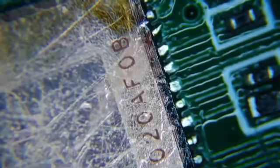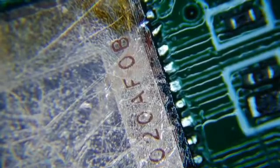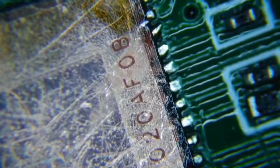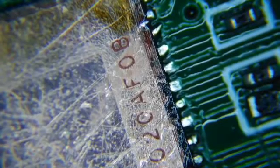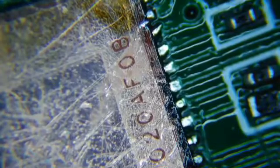If the voltage test doesn't work, I'm going to come back and try to reflow this one more time by putting flux on either side, heating the chip until I see molten solder, and maybe tap or move the chip a little, then try to get it set again. After that, if I can't get it to work, I'll pull the chip off again. You may see another video out of this — probably will at my luck. Thank you for watching, hope that helps. I wish I had a steadier hand, but that's what I do. Thank you very much.